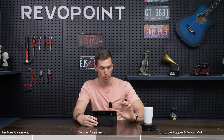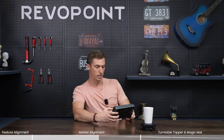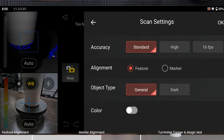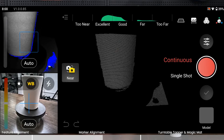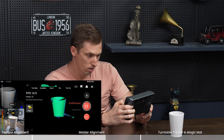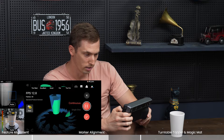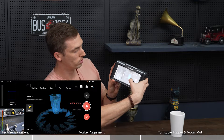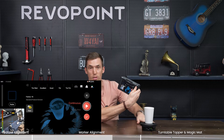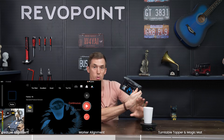What about near mode and a cup that's very symmetrical — where could we go wrong? If we're in near mode and under scanning settings the alignment is set to feature for an object like this, what's going to happen? I start scanning and it starts spiraling out of control right away. To fix that — same concept as the table — the symmetrical cup needs to have markers, so let's put some markers on it.